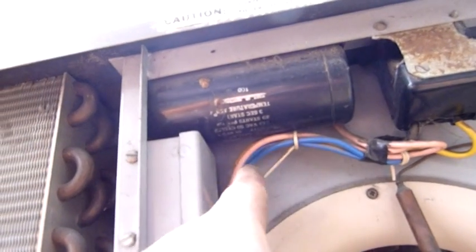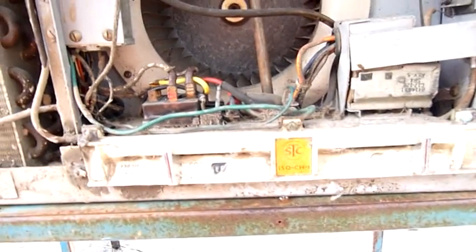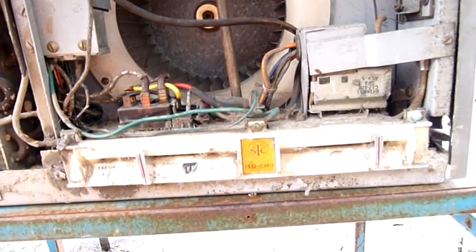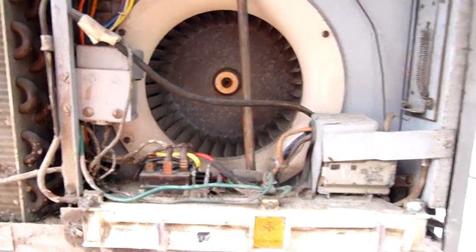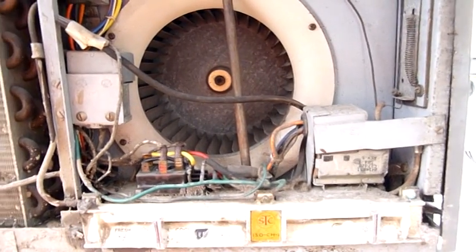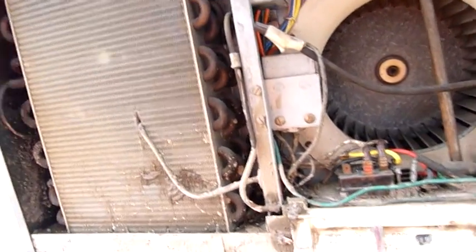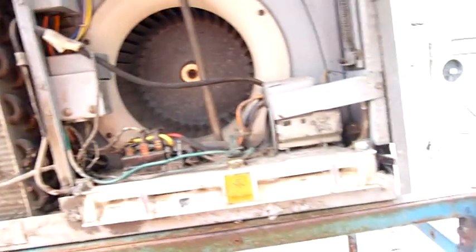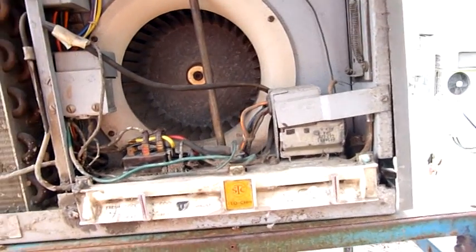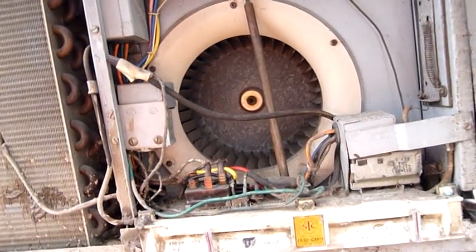Start capacitor, 240 volt, 50 cycles. I haven't noticed the term hertz used in this one. I think it was Oleg who was saying the term hertz came in after '63 or something. So this might be an early 60s or even late 50s model. I'm not sure when R22 came in for heat pumps but it'd be around that time, because all the frequency on this is measured in cycles per second, not hertz.